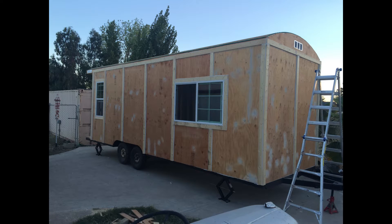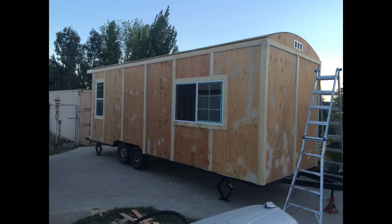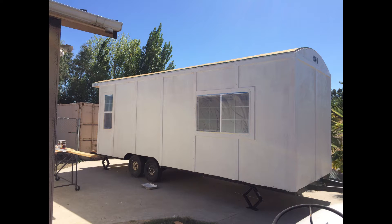For the siding, since I used plywood that has some knots and cracks, I used a product called Pro Bond Wood Filler made by Elmer's. It's a little pricey, but I went around and filled all the little knot holes, voids, and cracks with it — it worked really nicely. I used a putty knife to press it in, then came back a couple hours later and sanded it off to get it all sealed up. Then I put a layer of primer over the whole thing.